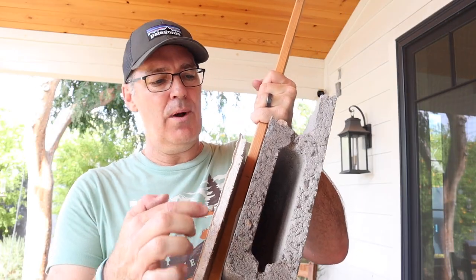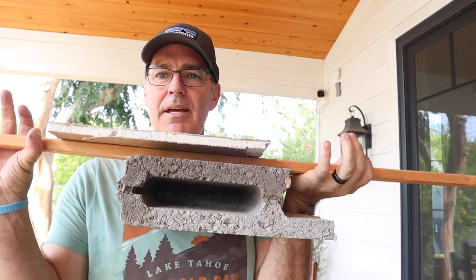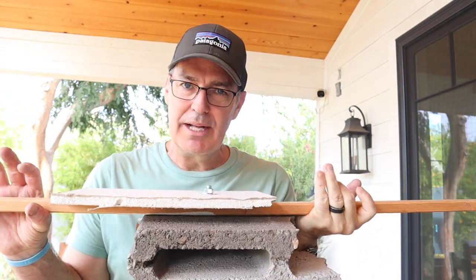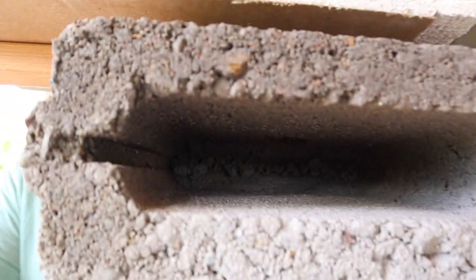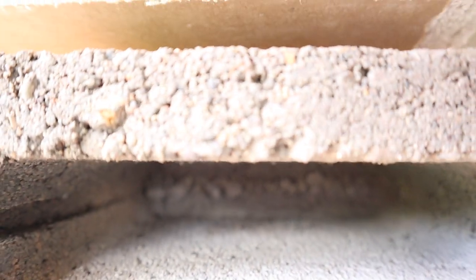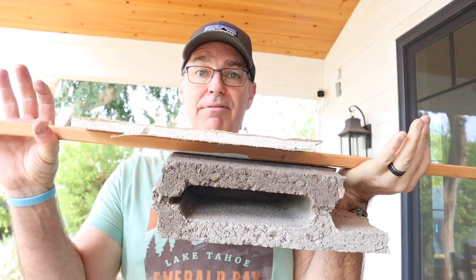The reason I mentioned half inch drywall, half inch fur strip, maybe three quarter inch block is you want to figure out how long that sleeve anchor is going to be. This one was obviously too short because you can tell it didn't even go all the way through, but it is wedged right in here and this is fine. My feet are under it and I'm not worried.